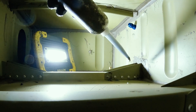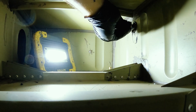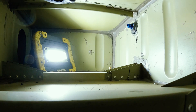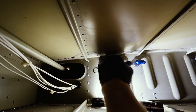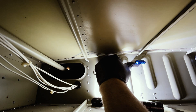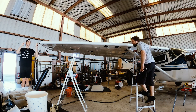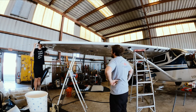So that's what the tip tanks will send fuel into once you turn on the pumps — that will suck the fuel out. There he is finishing some applications, really making sure it's painted and coated around the structure. You want to make sure it's a really good seal and you don't want to have to come back and do this again. There I am putting in the fitting on one end while he's applying sealant in the other tank — just another view condensing all those steps. Now he's tightening it on, I'm holding the back side, and that's what we're going to tie in from the other tanks.